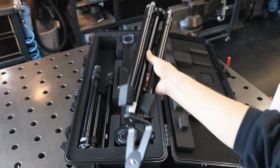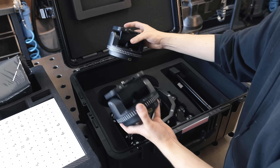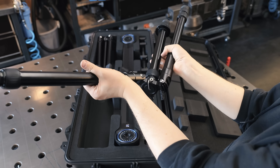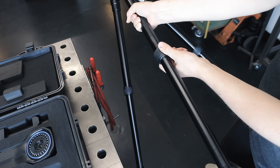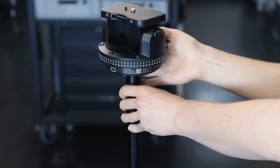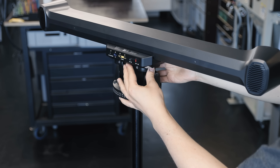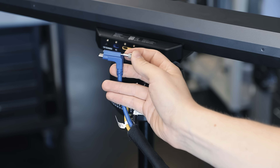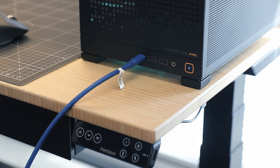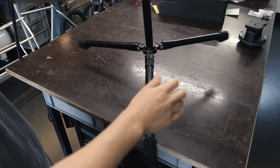Besides those two main units, most of the other stuff in here is used for another very cool feature of the system, which is the automatic calibration. To show you how that works, I'm just quickly going to set up the tracker unit. This is the main tripod for the tracker, and on top of that we're going to install the tracker gimbal and then the tracker itself. Then we just got to connect a bunch of cables. Everything is USB-C on this, and they thought of everything because the connectors actually screw in so they can't fall out. The blue cable connects everything to your PC, the black cable connects to the scanner, and the yellow ones are just used for calibration and can technically be removed when you're done with that.